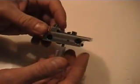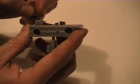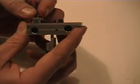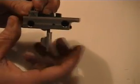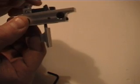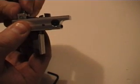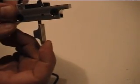This is a very basic trigger — it has two moving parts. This piece here touches the rear end of the striker, so when the striker is retracted it lifts the sear, keeping the striker from moving forward. When the trigger is pushed — striker retracted, cocking the gun, and fired.